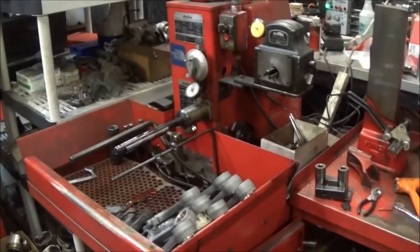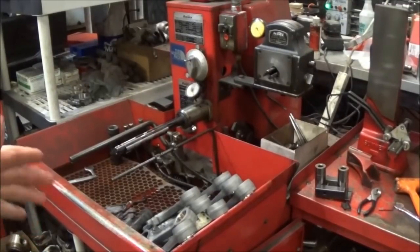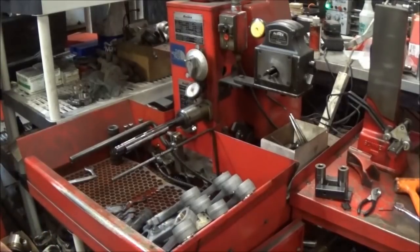So here's the final process for the rods. I have the other mandrel set up here, the honing mandrel, and I have my 8 rods here. As you can see, we pre-sized them over on the mill, so they're in the range of 3 to 4 thou off from where we need them. So we'll go ahead and hone them, and then we'll test fit them with a pin. We'll get it into size, then you put the pin in it and just test it out. But here we go.